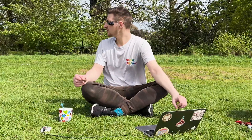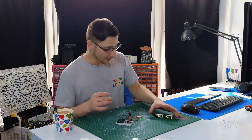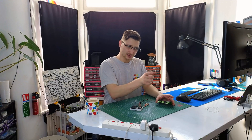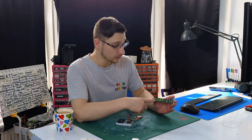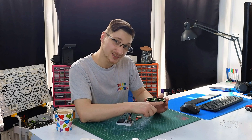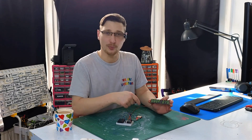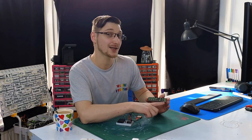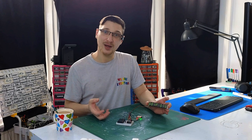Where is home? I don't know where I am. Good news — I eventually found my way home. I realized I had a GPS device with me. When I did get home, I connected the screen to the microcontroller and programmed it to tell me the speed over distance over time, then got it to display on the screen. Over here we've got miles per hour. I'm going very fast, as you can tell. It can't print the letter M, so it just prints the letter P. Down here it tells me how many satellites it's connected to — it's the best way to tell whether it has a good position lock, apart from this little blinky LED. We've got 07 satellites. You might think that's a 5, but that's actually an S. Now that we've got it working, I'm not sure it works yet — I've not been able to move very fast with it.